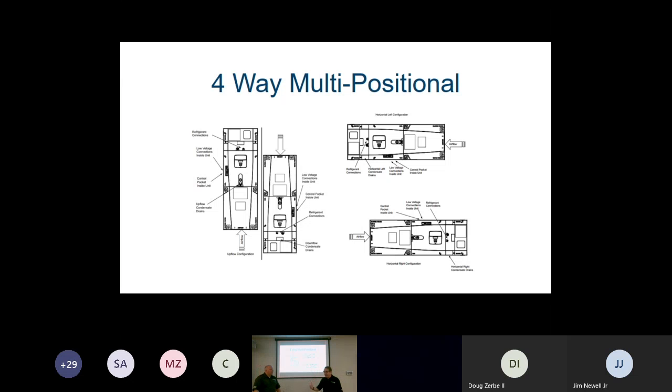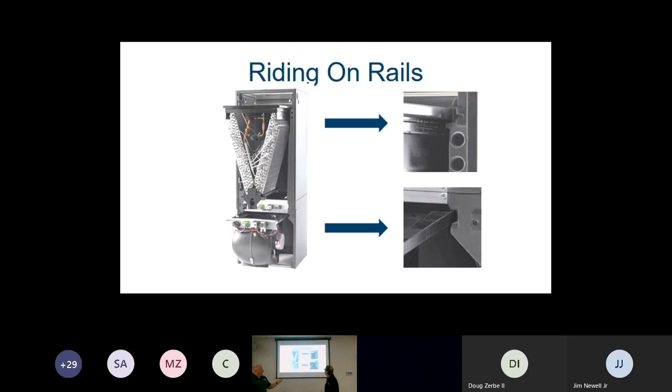And with the TM9s, the CDA allows us to go in and see actually what our airflow is and what our static is. I went out on a job site like John's talking about, and the ductwork was restrictive, and they were actually complaining about water coming out of the door itself. When I looked on the CDA, I saw the static pressure was at 1.3 inches. The unit's just not designed for that. The blower's doing everything it can to push the airflow, but the ductwork was restrictive, and that's what was causing the issue, particularly in a horizontal application. Right, and this was a horizontal, yep.